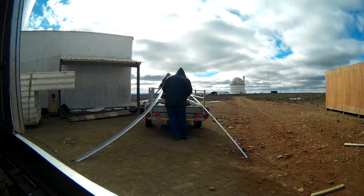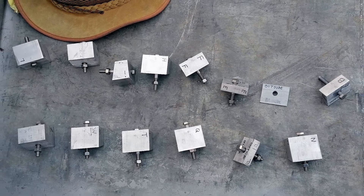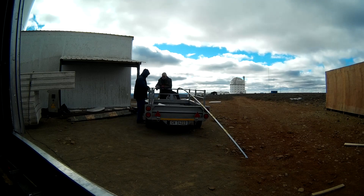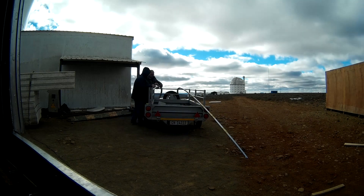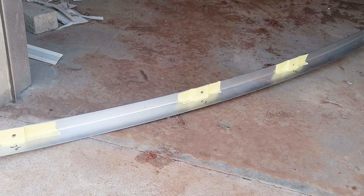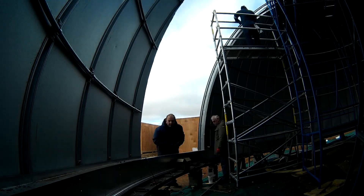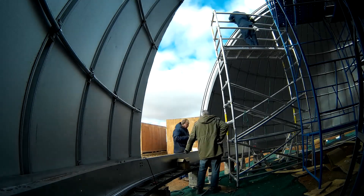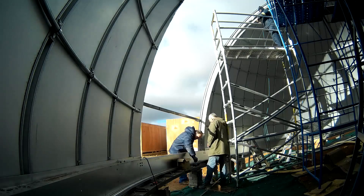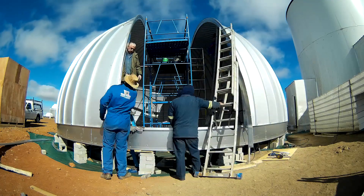What Hugo and I were busy doing here is something that Nick and I improvised during the Atlas dome assembly. A fairly complicated set of wedge blocks, all going in individual positions along the shutter track and its accompanying cover strip, is fairly finicky to assemble — particularly the inner blocks which are difficult to access and notorious to fall. Nick and I found that by taping them in position beforehand saves ages of grief. Even Rayleigh agreed that this is a brilliant idea and that they may even consider spot welding the wedges on in their factory in the future. A spreader bar ensures the correct spacing between the shutter tracks is maintained, and after some sealing, these strips are followed by side gusset plates rounding off the shutter aperture nicely.